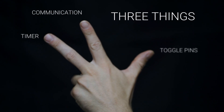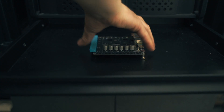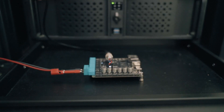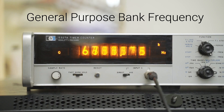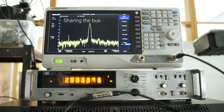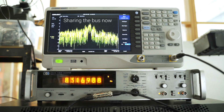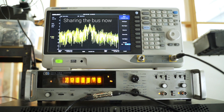In the A64, there are two classes of GPIO banks. Several banks are connected to the main bus, but one bank is special and connected to the dedicated bus for the AR100. I set up some tests comparing the speed and predictability of these two types of GPIO banks. The special bank uses four instruction cycles to toggle the pin, while the general-purpose bank uses 18. What is more interesting is the amount of jitter on the transitions.